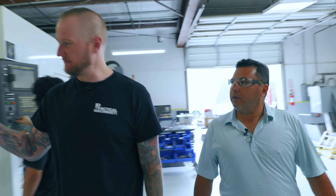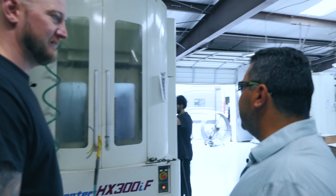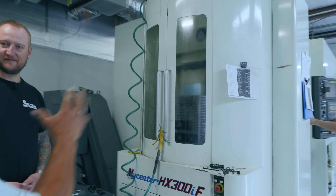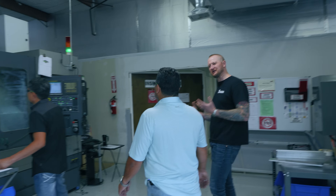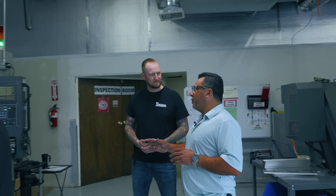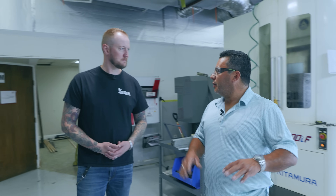Look at this — so this is where the pallet actually changes out. That would be our next set of parts on the back side. You can set two different parts running at the same time, or use both pallets for the same part. Are you guys building your own tombstones? Yes — that looks custom. We also have a Leadwell. Why was that the choice? Because Leadwell is local — they can come same day to fix it if it breaks. They're only about 30 minutes from here, so parts, service, everything you need is here pretty much every day. We use the same kind of clamping bolts so we can keep them consistent across machines.